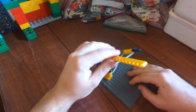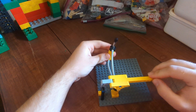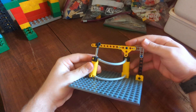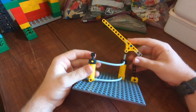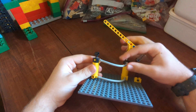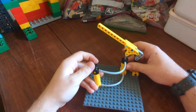You could even turn it around and use this as the lever. Because I'm using cylinders of about the same size, the movement is pretty linear in how it works — as much as this one goes down, this one goes up about as much. There's a bit of lossage due to the inner space taken up by these hoses, so it's not a 100% efficient system.